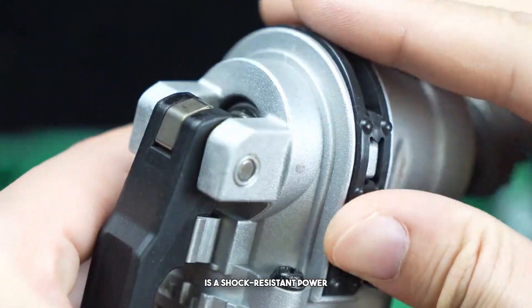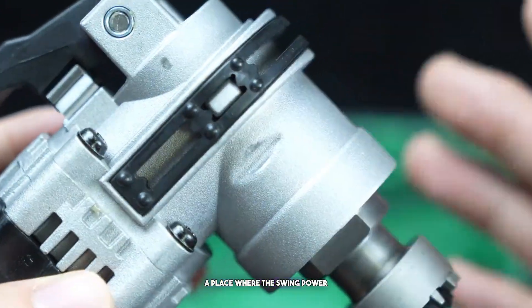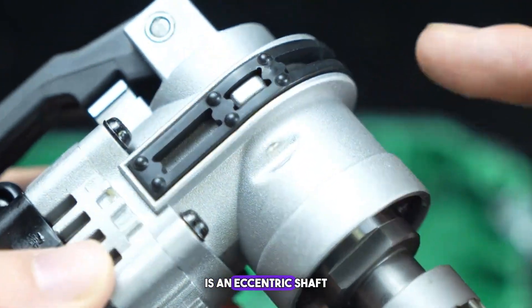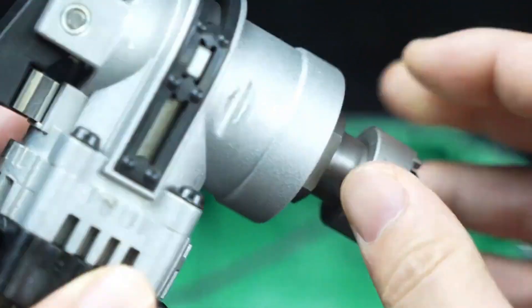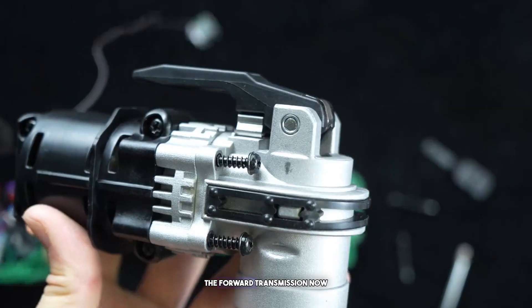Taking it out — this is a shock-resistant buffer in front of the motor. It places this cushioned material in the area where the swing force is greatest. Inside is an eccentric shaft, and the eccentric axis makes a side-to-side swing, which transmits a very large shock force forward.